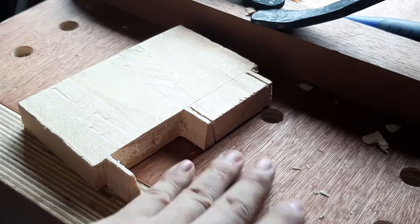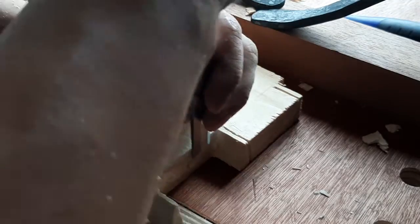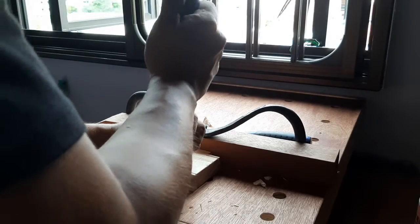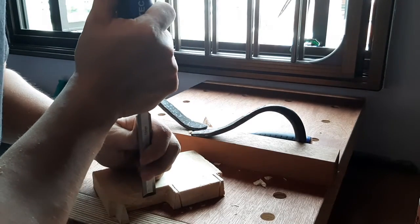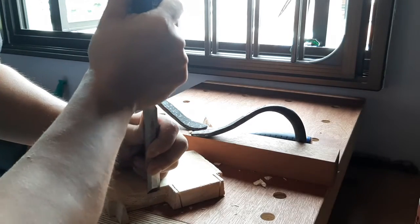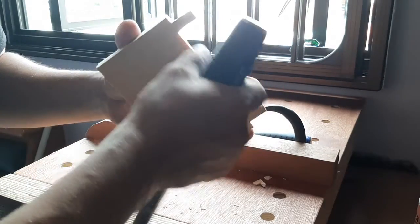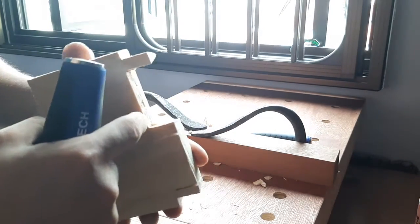Paring, there are two styles. First one, you can do it so. Just hold the chisel as such. Let me zoom out. And wiggle as you go down. So instead of pushing straight down, try to wiggle. That will be easier. Because when we push down too hard, sometimes we'll overshoot, then we'll slice beyond and hit the walls below. So if you slice into this wall, then there's no more reference on the other side.